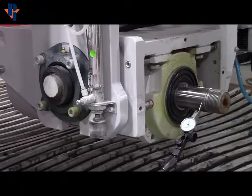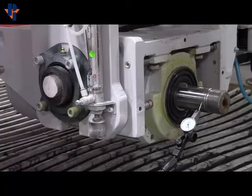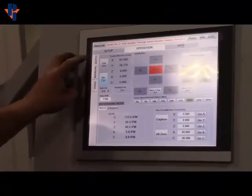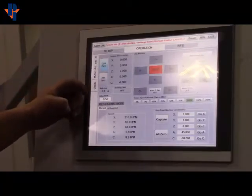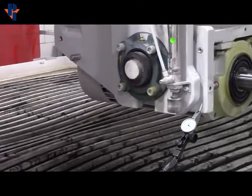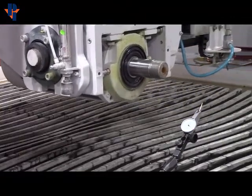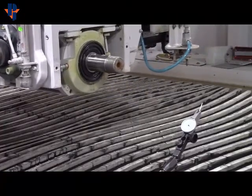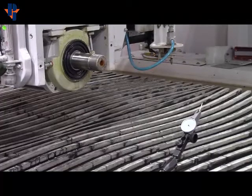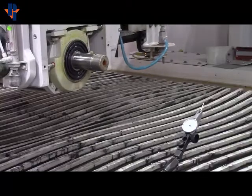For the C to Arbor, you're measuring X. Drive in X minus until you just touch, sweep with Z until you find your high spot, then one thou X minus until you're at zero, and hit User Zero. That'll clear all the values out. After User Zero, go X plus to make sure you clear everything, then Y plus — go quite a ways back, because the C axis is going to turn all the way around. Once you get back to where you can safely turn, stop, go to the screen, deactivate the pendant, change C to 180, and turn it.